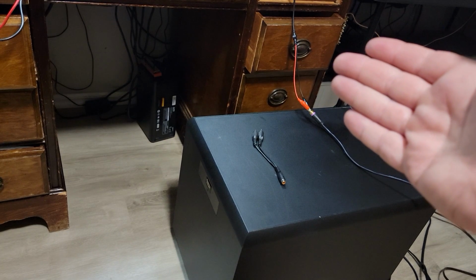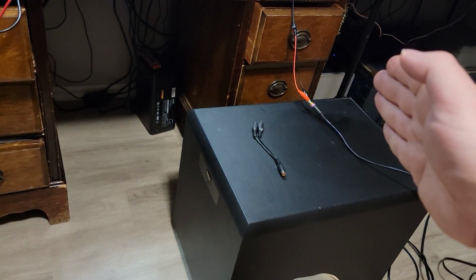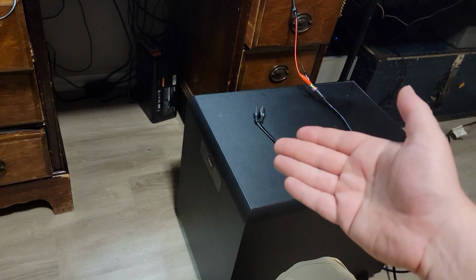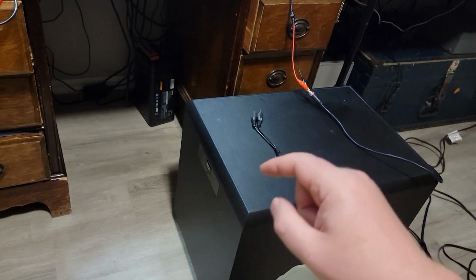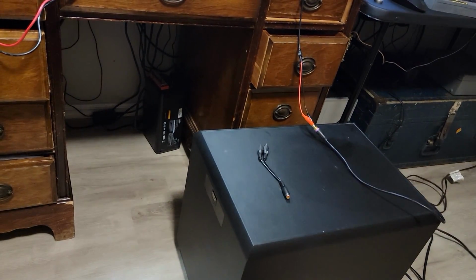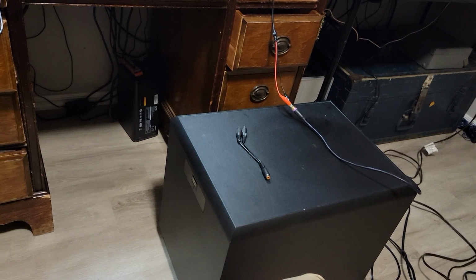It took some time, but eventually the audio came through, because that voltage was not good enough. We were able to test out the audio through the entire board. It didn't all look good. And then we put everything back in just to see if it could drive the speaker, and it could, but it took forever to warm up because we needed to resolve that issue with our positive 9 volt rail. So we took everything back out and troubleshot it down some more to a 220 microfarad capacitor that also needed to be replaced, although we went ahead and replaced all the caps because why not. I am very happy with this and glad I'm able to now return this back to the customer, and he should get some enjoyment out of his subwoofer again.